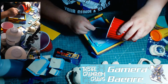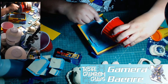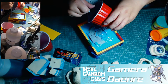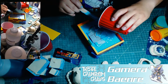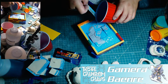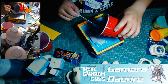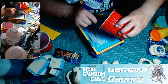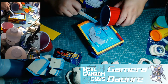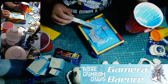And once this is pressure cured, I could go ahead and apply another layer of silicone to finish this off. What I don't want to do is mix another batch of silicone and then pour it in immediately because the cure ratio is already changed. This is already on its way to curing, so I don't want to mess with that. I want to do it at single batch times. Now, what happens when you have different cure ratios is you might end up getting bubbles forming because a layer underneath has cured before the top layer, so you get some weird bubbling, or the top layer might cure faster than the bottom layer. So it's a good idea to avoid that.